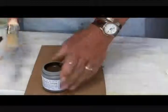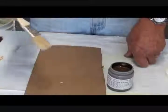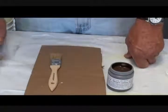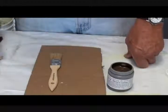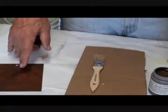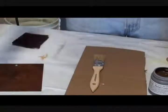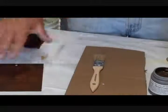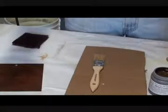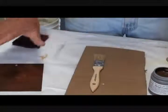Okay. So this is water-based, and there's no surface prep. Obviously. Well, that's not true. If you were going to do a piece of steel or iron or aluminum, you would have to put a primer first. So I recommend 2 primers, a zinc primer first, and then a good basic primer such as Sherwin-Williams or Rust-Oleum on there, so that you have at least a couple barriers between the coating and what you're going to do to the metal.